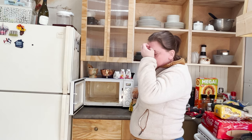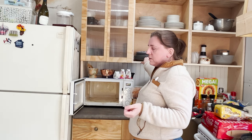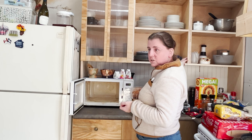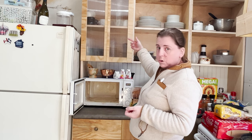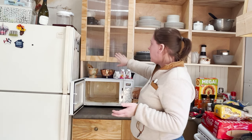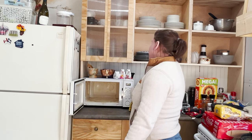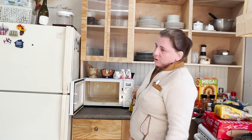I'm trying to figure out how to fix this. I don't mind having to reset new hinges — basically take out the plates currently installed, dowel, wood glue, reset them, and re-drill a new hole if needed. It's going to be a pain but it is what it is. These were fit in and we're just not quite there. But it looks cool — from that far away it looks pretty cool. Please don't blast me, woodworkers. This is a process of uber affordability: how do we make this look high-end on a low-end dollar?